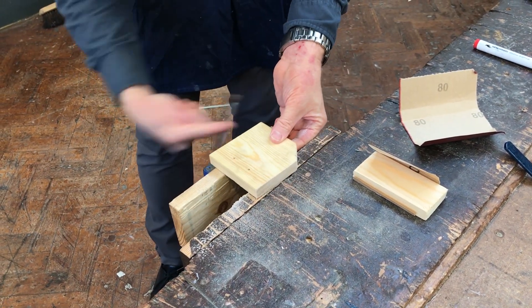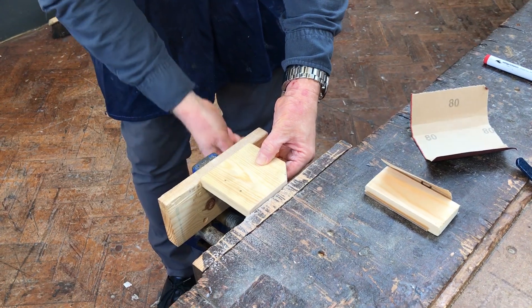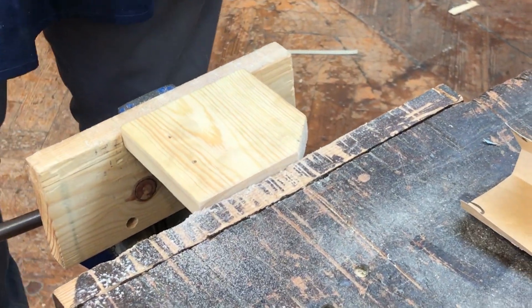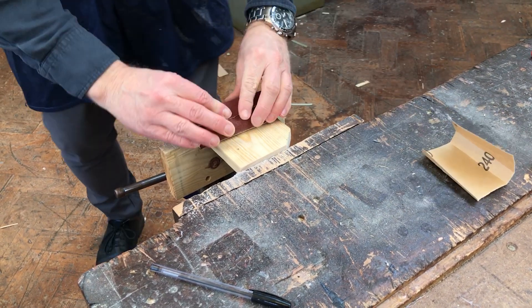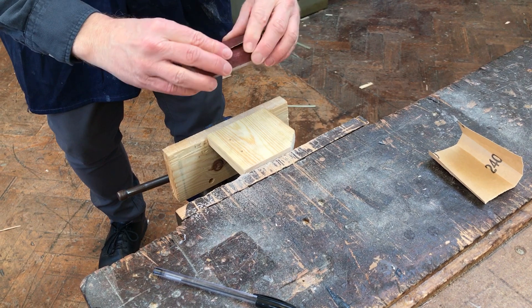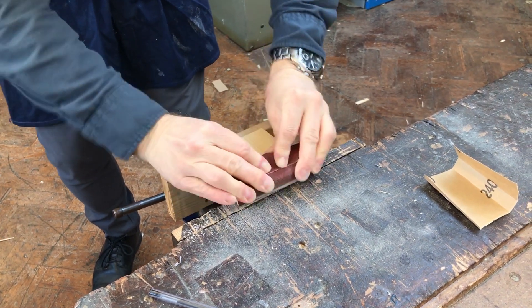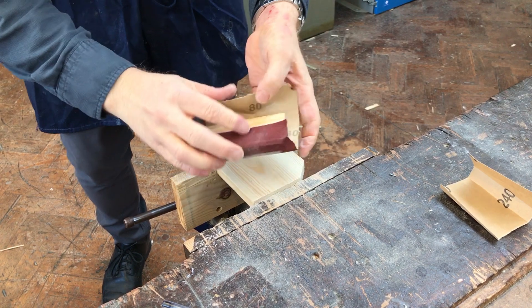To sand the front, open the vise up like this. Make sure it's sticking out of the vise about halfway, so it's not below the vise, because you'll get your fingers trapped when you try to sand it. Wrap it round — start with the 80 first. This feels quite smooth, but there's still marks on there left from dirty marks that we can remove. Go with the grain — you can see the grain lies of the wood there. Hold it nice and tight.